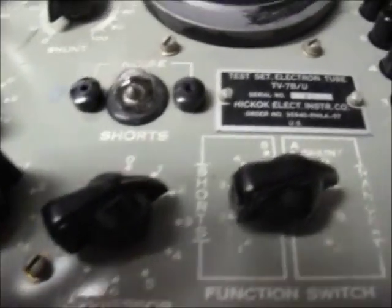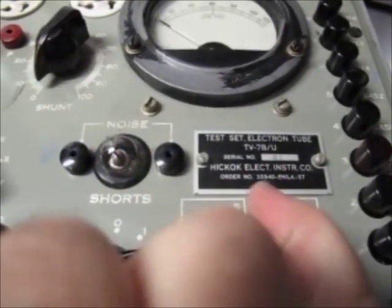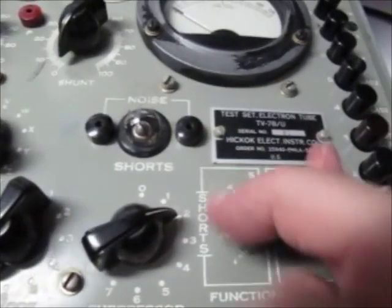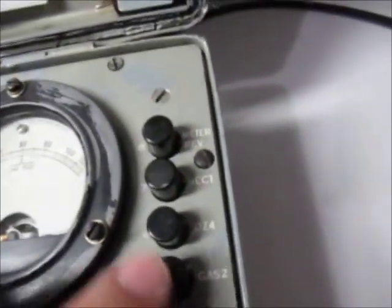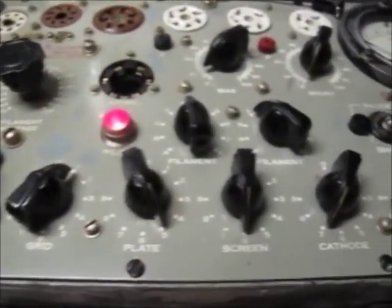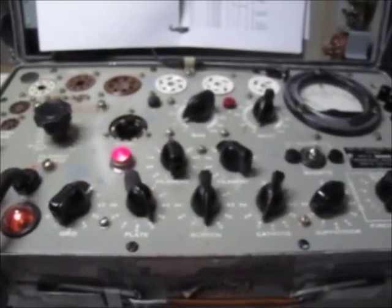One of the other functions I haven't shown you is that there are short checks here, and there's a little neon which tells you if there's a short. We can go through to five and three — basically checking all the inter-cathode connections — and it looks all good. I have had tubes before that come up and give a problem. There are also gas checks here, though I haven't used them myself. There's a rectifier check I have used, and an ability to reverse the meter. For the functionality of just checking basic tubes — B9s, B7s — it's an excellent unit that has saved me many hours of trying to diagnose a receiver when in fact the valve is low, bad, or shorted out.